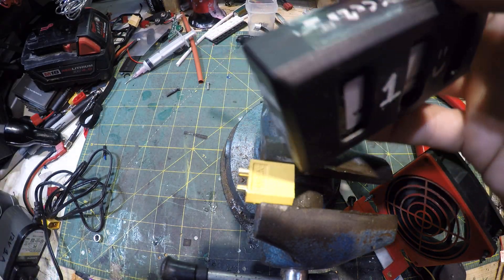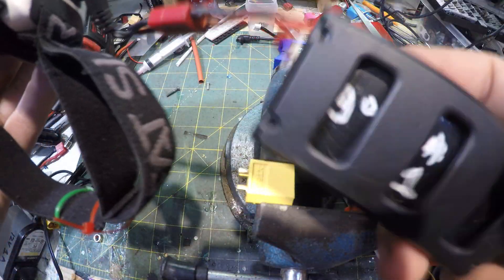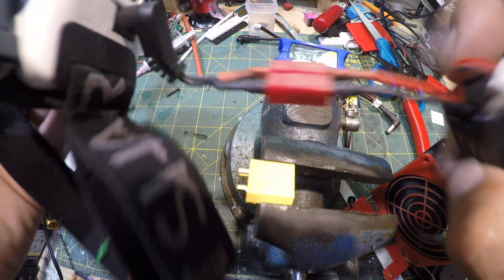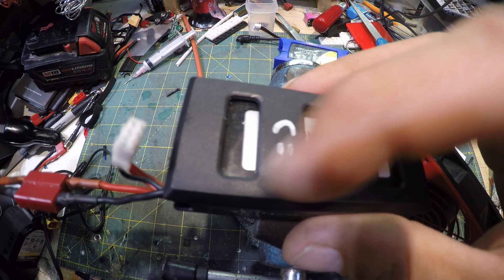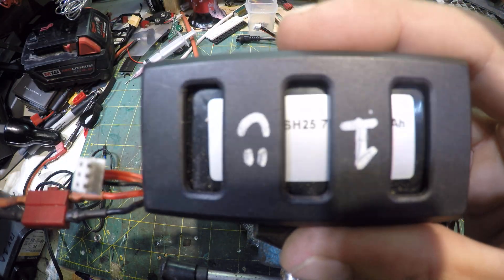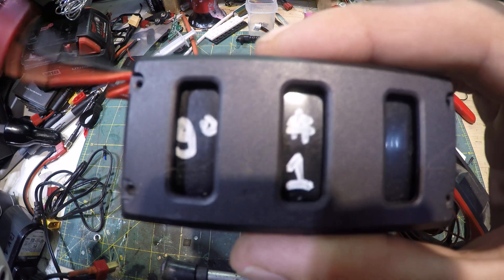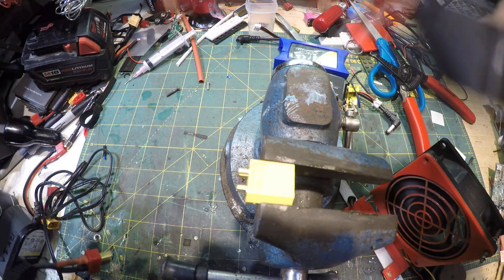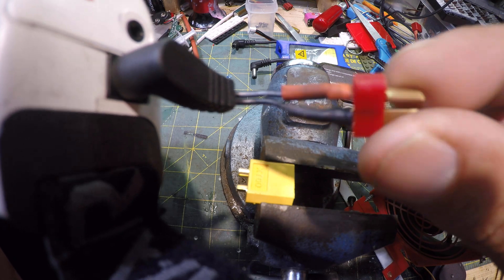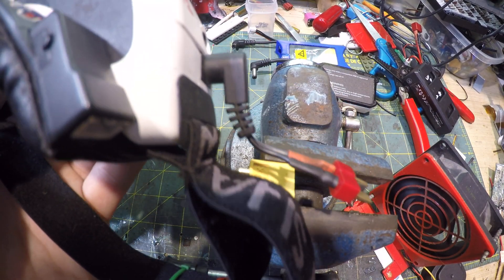You don't have to buy a fancy battery. If the battery's the same size, you can even put it in that little slot - I like putting it in my back pocket. It's an easy adapter and you don't have to make a special battery. A lot of these tutorials tell you to make a barrel plug attached to the battery, but then you can't use that LiPo for anything else - you can only use it for FPV goggles. I like this because you can use any 7.4 volt or whatever your FPV goggles accepts.